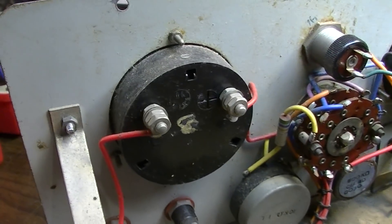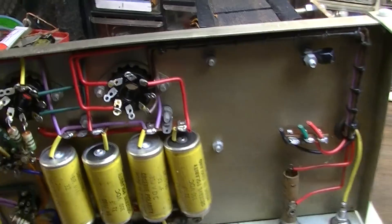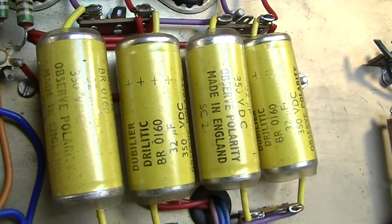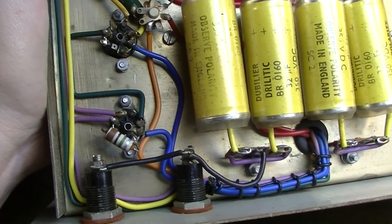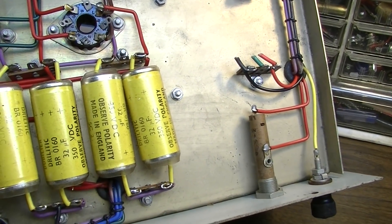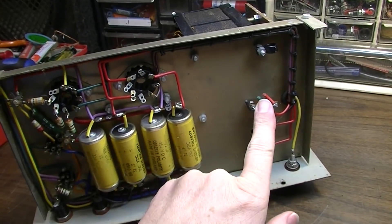Just cool meters on this, very well built. The capacitors are a dry electrolytic, so they might be okay - we'll see. I think this thing is from 1955. I've obviously got an EL34 and a rectifier tube, and I'm going to have to order those other two tubes. I'm also going to have to replace the power cord that somebody snipped off.